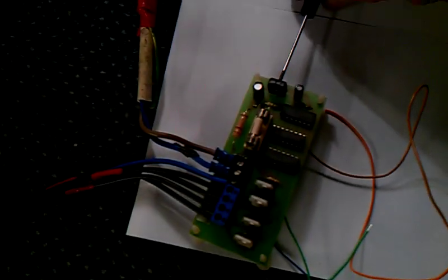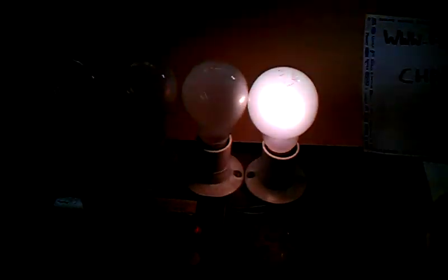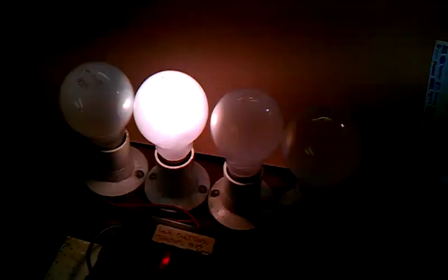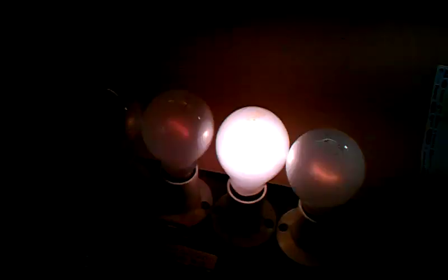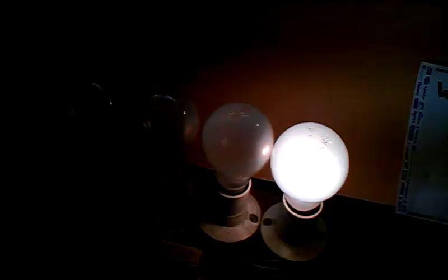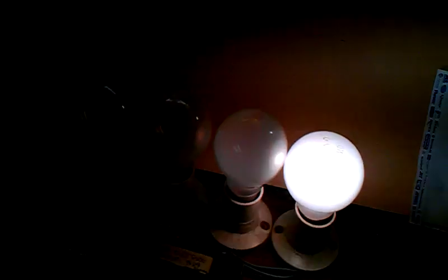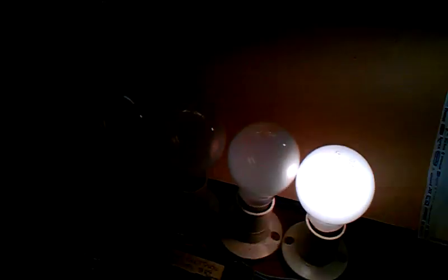At the moment I've twisted them two together — I think that's the four lights that should start chasing. And as you can see, I've wedged a screwdriver because I'm trying to do this one-handed in the speed control. Let me turn on. Here we go — there's four light bulbs flashing. That speed is in the middle on the speed control. What I should be able to do now is speed it up. If I do it slowly you can see the speed it can do. Right, that's all the way — that's the fastest flash. And then I turn it down slowly. When I get to just past halfway, it starts to take a long time.